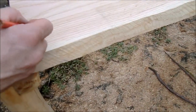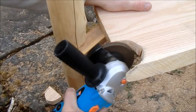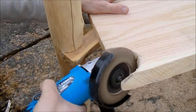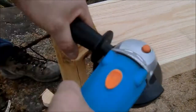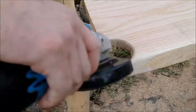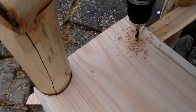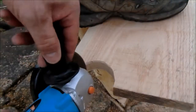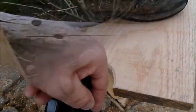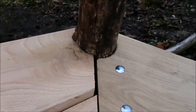On the other side I am marking roughly the radius of the leg, cutting with the jigsaw and then sanding to the final fit. Drilling holes for the carriage bolts. This is the cutout for the back leg post. To get the correct fit I had to mark and cut a few times, removing a few millimeters each time.